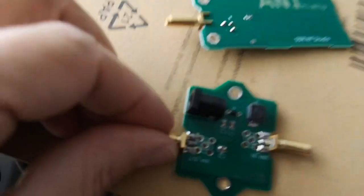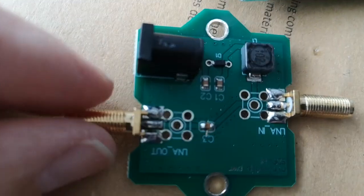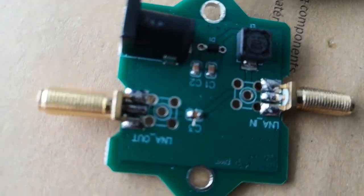I did read some reviews where people said it fried the front end of their receiver, because it put voltage out from the power supply section — that's the power feed into the coax. So I thought I would check to make sure this is not putting out 9 volts into the receiver input, and it was.